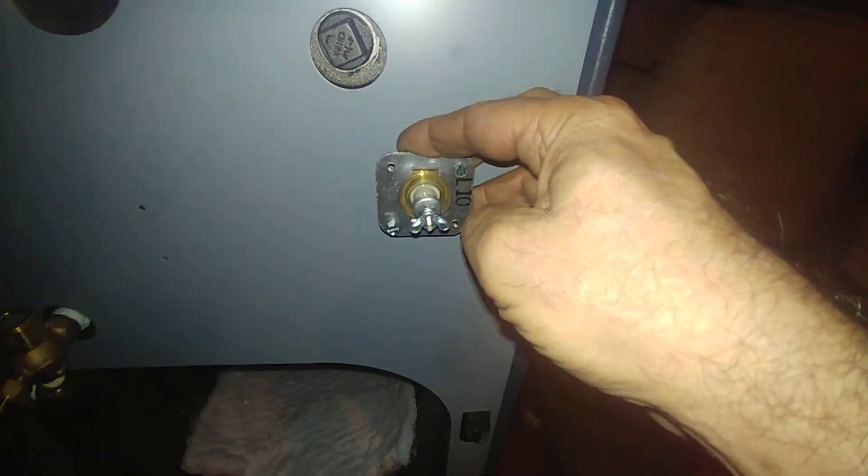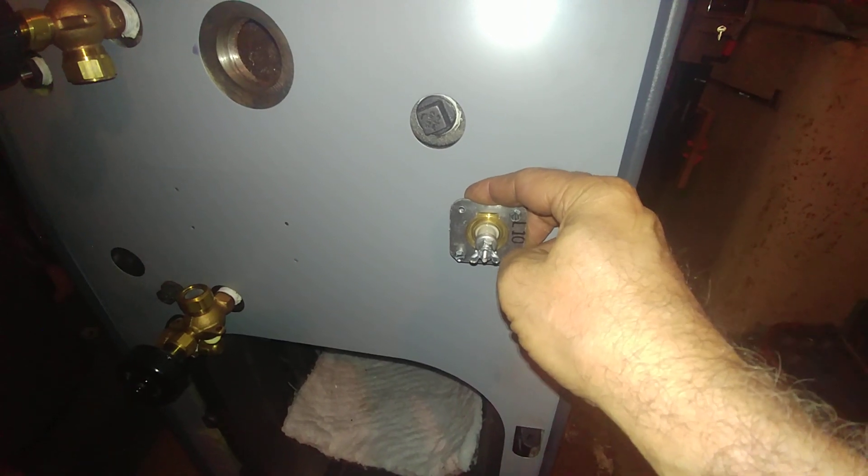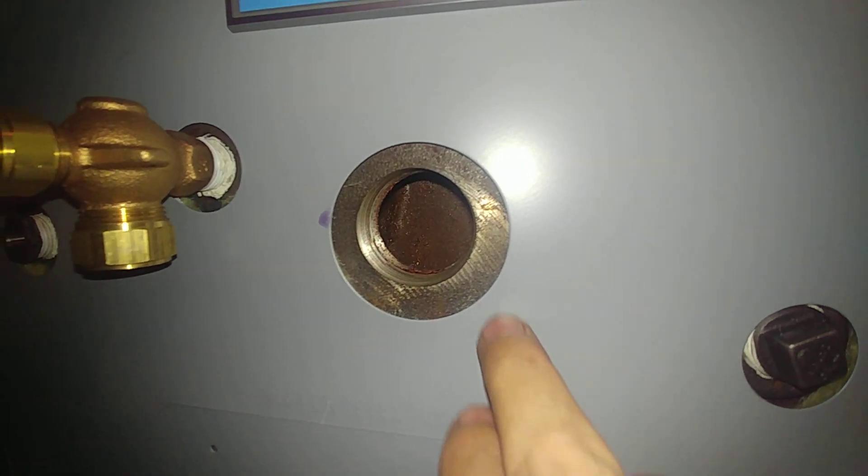The semi-knockdowns do not come with a low water cutoff — you add your own. So this is ours. This is where the probe is, and this is where the box is going to be mounted. This is the skim tapping here.